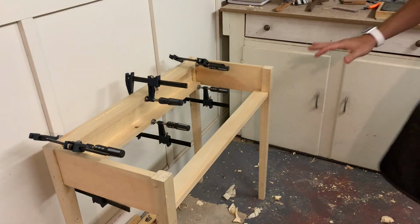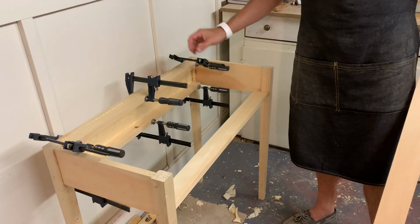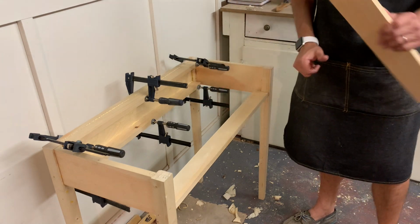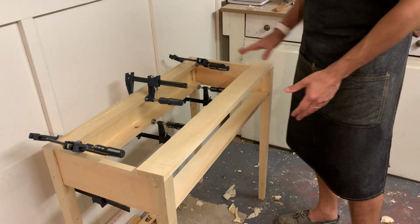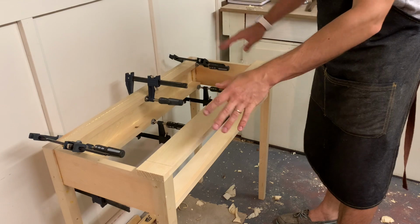All right, let me tell you why I'm doing what I'm doing here. Basically I want something that I can attach the top through. This will give me extra supports for the drawer top kick and the runners. This will be the dovetailed front rail, and then I'll just connect them with mortised in pieces. Before I glue everything up, I'll mortise everything in.